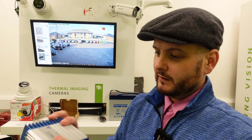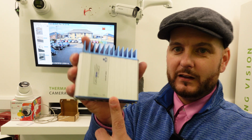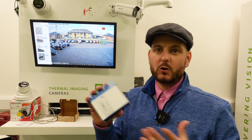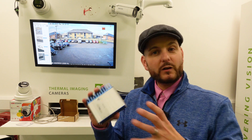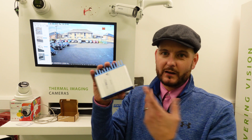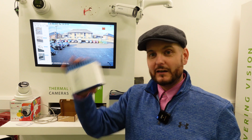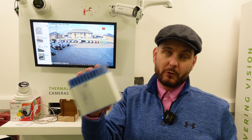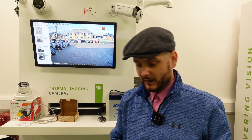As you can see, it's a cam switch for mobile. So if you're fitting towers — these are great in lots of different applications: towers, mobile deployment. If you want to use battery technology but power POE cameras directly from this and connect it to an NVR or 4G router also powered by 12 volts — to get that across to your arc, your monitored site, your end user via the app — this is a handy little conversion device which will allow you to power cameras off POE and connect the network element up to a router, NVR, DVR, etc.